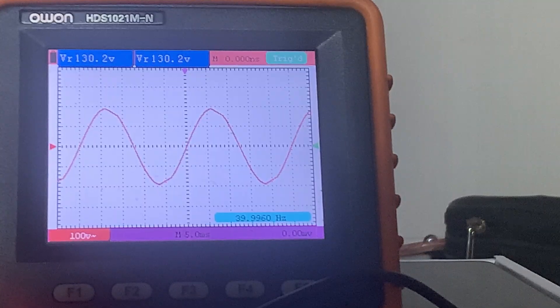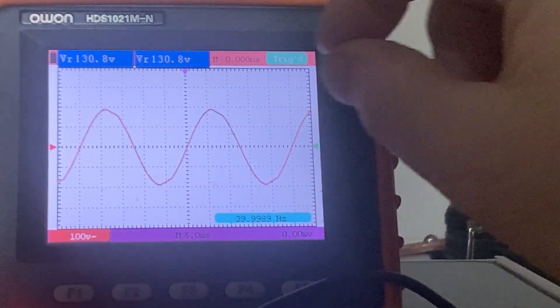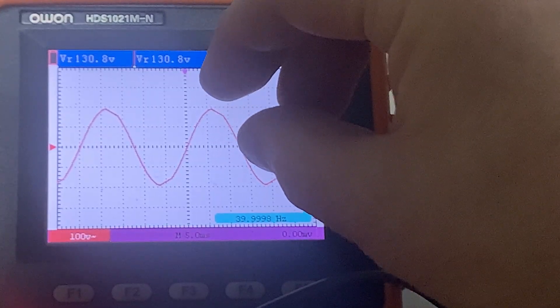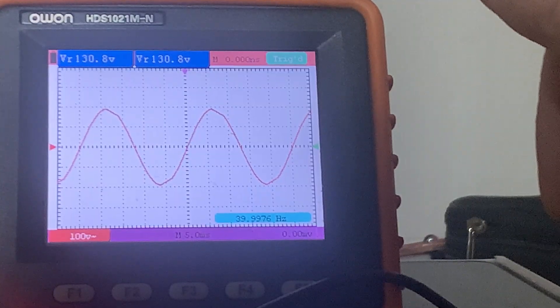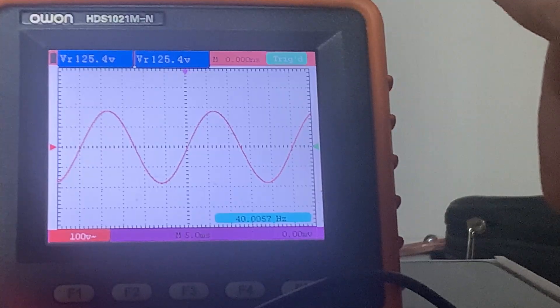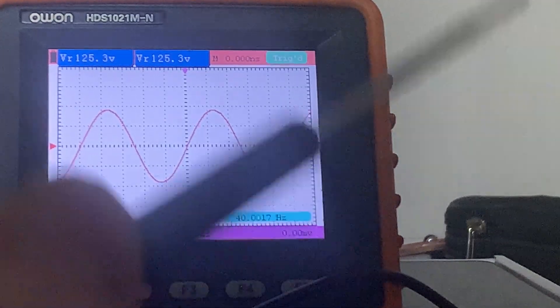The clip light on most amplifiers that have one tends to come on prematurely. Now this one — I misspoke before — this one is NOT reacting like the MD series Taramps or the Sound Cubed U18000. On those, right at the top and bottom of the sound waves it would start showing a bubble — like a big distortion-type bubble — once it got close to the clip point. So this one is actually cleaner than the Sound Cubed U18000 or the Taramps MD8000.